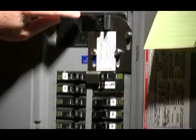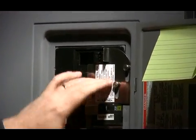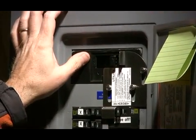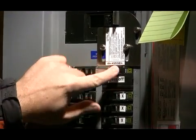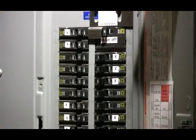The way this works is, in order to turn the back-feed breaker on, you have to turn off the main supply breaker to the house. Once you turn this off, you'll be able to slide this mechanical plate up and then turn the back-feed breaker on. When the power goes out, the sequence of operation is: secure the main breaker, then turn off all the branch circuits — every single branch circuit. Then go outside, start the generator, plug it in, and come back to the panel. Turn the back-feed breaker on, then start turning on the individual circuits one by one. I've pre-marked all of the circuits that I know I would use in the event of a power outage, which saves some time rather than having to do guesswork.